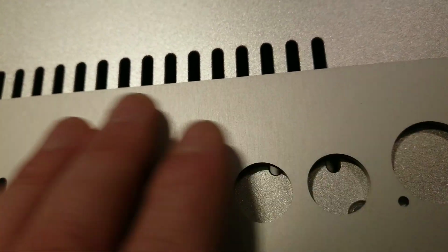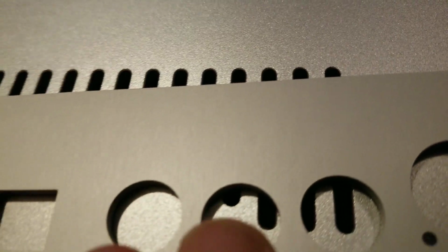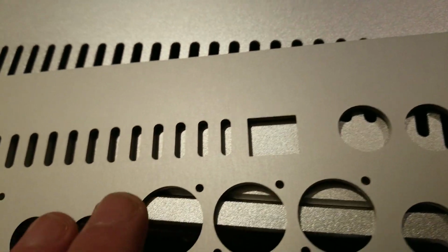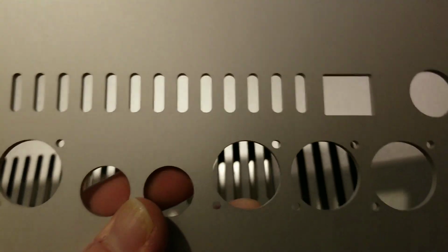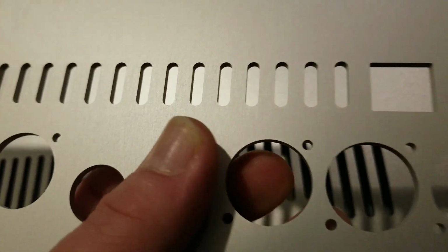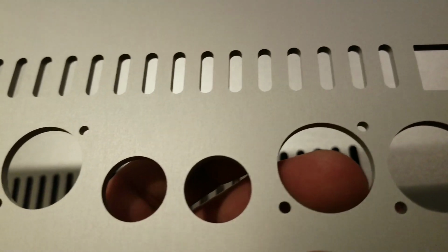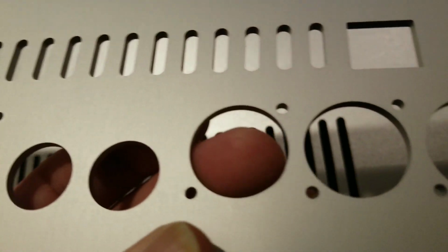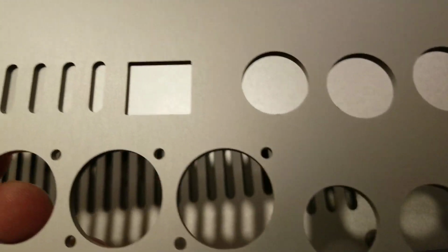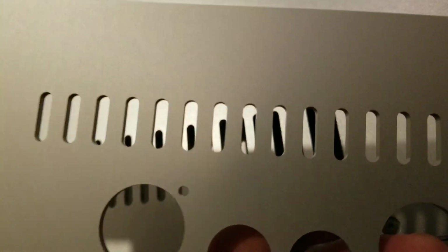This is more expensive for sure because it's so nicely machined. There's grain, okay? I don't know if you can tell, but there's grain. Anytime there's grain in aluminum, it means they have to run it on sandpaper, basically. It's like a giant belt of sandpaper, and they get this. But to get this kind of fineness without deep scratches, without anything messed up, you can look across and see there are no errors, no blemishes. So this is very high-end machining.